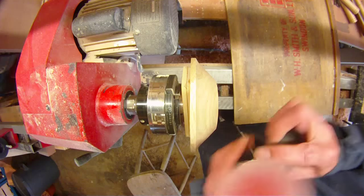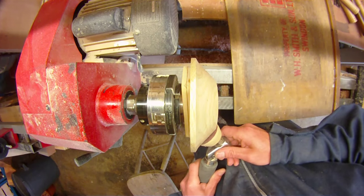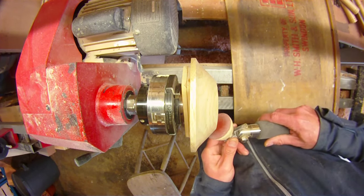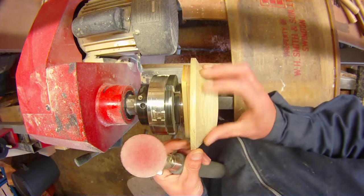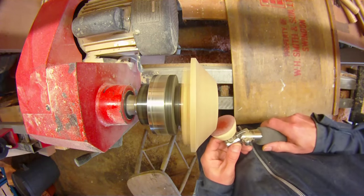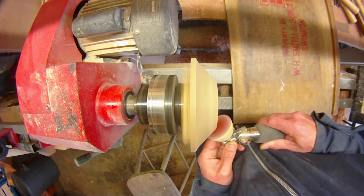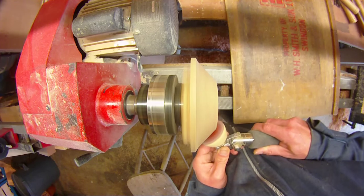It's just a case of running the pad along the wood and listening to it cut — you can hear a good cut. If it's not cutting very well, you tilt it down and you can hear the tone of the wood change. You can also use the bowl sander in the opposite orientation — rather than cutting like this, you can turn it around and cut into the curve. If you hold it up you'll get a fairly fine cut, but open up the angle between the pad and the wood and you get a much coarser cut, which can be very useful for getting little fluffies out of the way on the end grain.